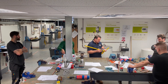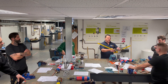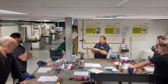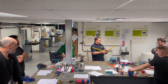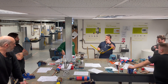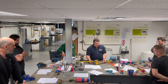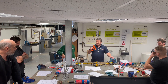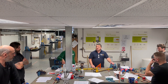On the sides you can see it's all marked up. There are three marks — they're a guide, not perfect, but a guide. The top one is 30 degrees, the next one is 45, and then the one right round is 90 degrees. It gives us a visual aid of where roughly we need to get the pipe. But when we're finishing it off to get the exact angle to a 90 degree, we'll be using a set square — that's a perfect 90.